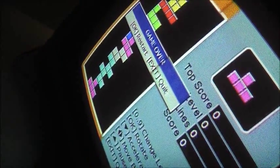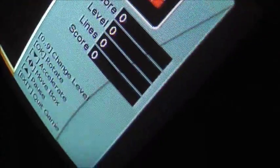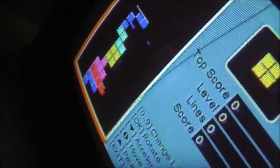After replacing that resistor, I found this one — the one in the middle — was actually more drifted. So I'll replace that with an identical one, which is tested okay. That brought the colour back a bit, so I turned the red drive signal down a little bit and look at that — the bleeding's a lot better. I can turn the brightness level up — the bleeding's nowhere near as bad. Colour all the way up. I think I can get it a little bit better — there's still a bit of bleeding there, but there are some more tweaks I can make.